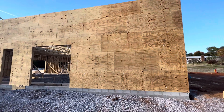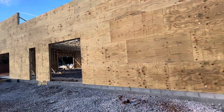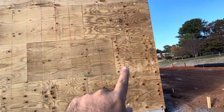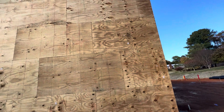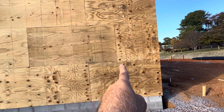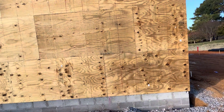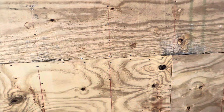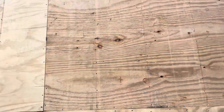Today I'll show you this project — wood stud framing walls. You can see the plywood sheathing for the exterior: one full sheet, then half, offset so there is no continuous seam — big piece, half piece, one full piece, half piece. They did a chalk line here, and there's a nail every three or four inches according to the design. You can see nails up and down — that's the nail work per the design.